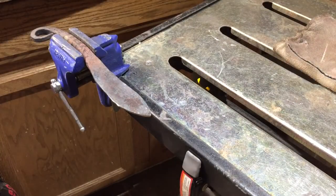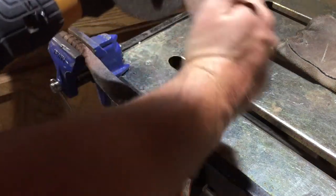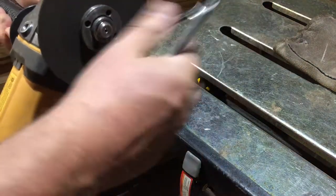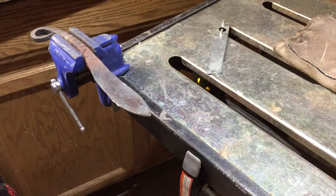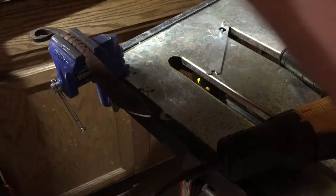Now to put the edge on I am going to actually use a grinding wheel. This was obviously just a cutting wheel, which is kind of what I needed to clean up the profile of that blade a little. One thing to be careful of is that you don't heat up the blade too much while you're doing this. I'm going to keep the blade cool because it's already heat treated, and it would be a shame to have to go back in when you've got really thin metal and try to harden it up again. Things are going to warp and everything else. So you want to try to avoid any discoloration as you're grinding on the edge.